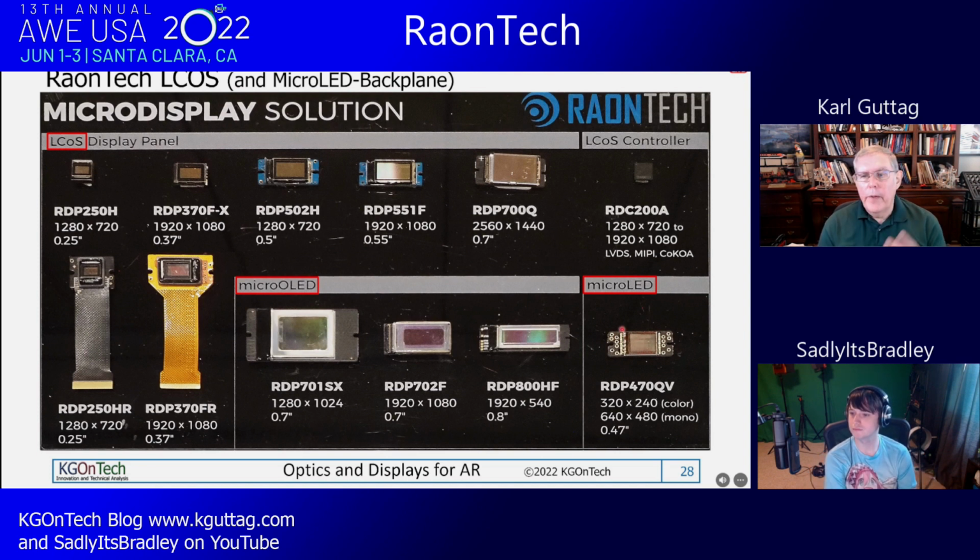Now, here's something important, though. When you look at MicroLED or any of these things, like LCOS, you have the backplane, which is CMOS. Compared to OLED or MicroLEDs, it's a fairly simple process. Plus, the backplane does not have to drive current. Remember, the light is coming from an external LED, so all the power is in the LED. What you do is you just put a piece of glass and put liquid crystal in there. It has to be high precision assembly, so it's not easy. But LCOS is relatively simple to make. The silicon underneath is dead simple, probably 5, 6, 7 generations old CMOS technology, so it doesn't have to support voltages or current.